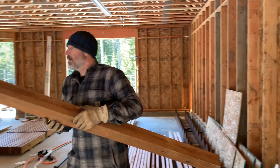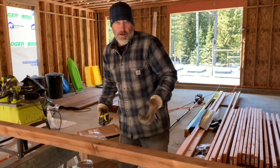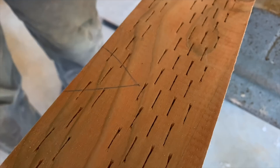These posts are eight feet. We want our handrail to be at about 38 inches high, and we've got 10 inches from the mounting plate up to where the tread's going to be. So we're going to cut these guys in half — four feet — and then later when we put the actual handrail on, we'll cut it at the right angle and all that.